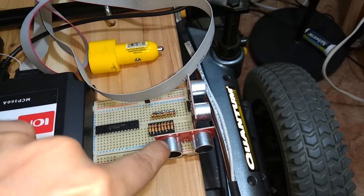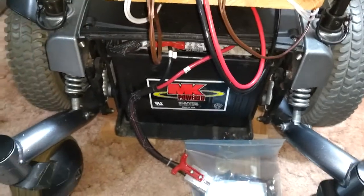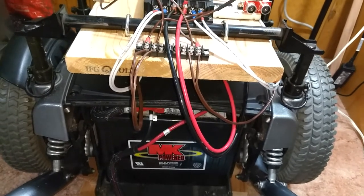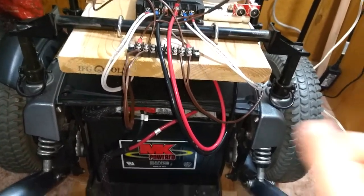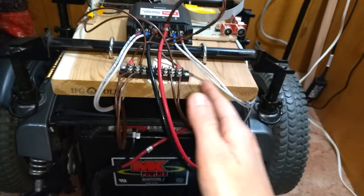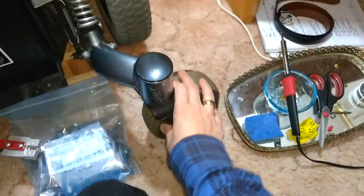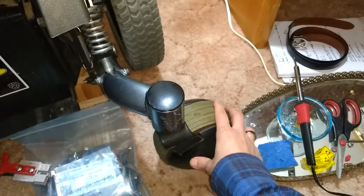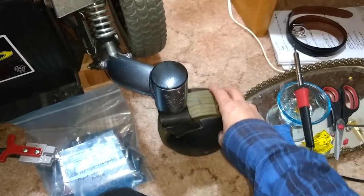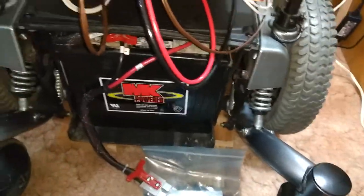There's going to be 8 of these around the whole thing, every 45 degree angle, so I can detect distance in front, so I don't bump into anything and have it steer away. And if someone's hand is a little jittery, make sure that it stays an inch or two away from the wall, so that the side wheels here don't hit anything. So maybe about 4 inches I'll stay away from the corners and stuff, the edges.